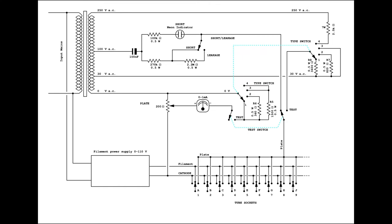Nowadays, low voltage, current regulated power supplies are affordable, therefore, instead of driving the filament from the power transformer, with so many output lines, such a power supply could be used. It should be possible to find something that would work, at least, up to 50 volts DC, which would allow it to operate with most vacuum tubes.